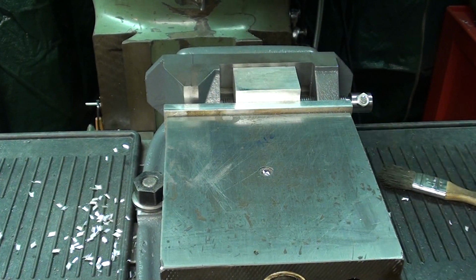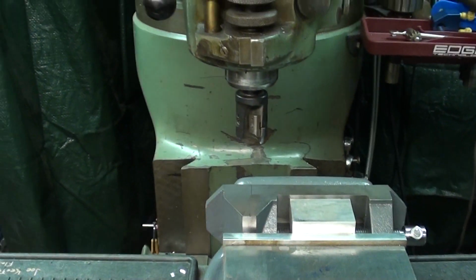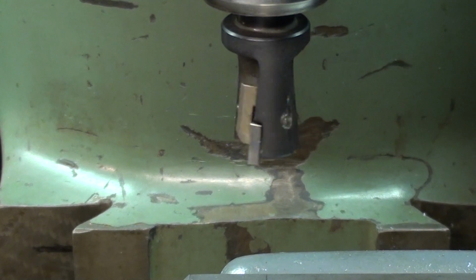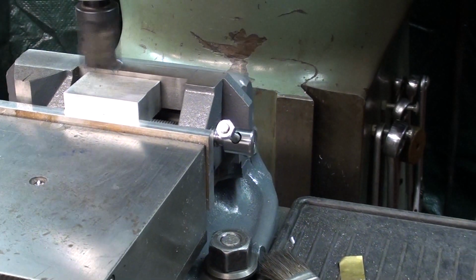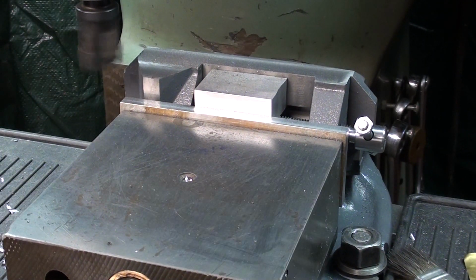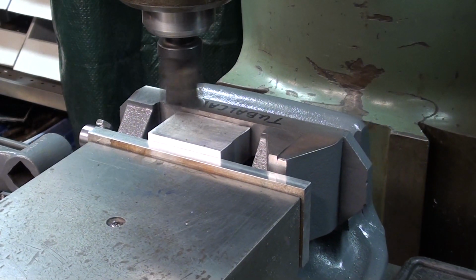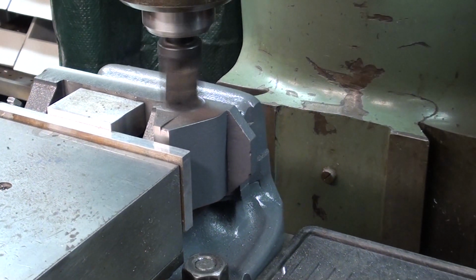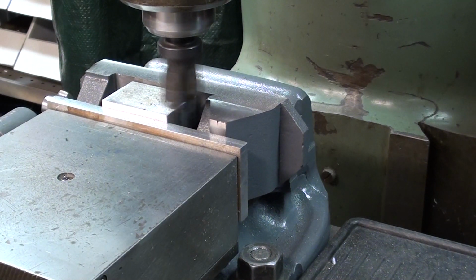And you can see that I'm not squeezing that or this. All of it is in the middle, and I'm using this 2-fluted carbide mill. 2 carbide inserts, I guess I should say. And I'll take one more light finishing pass off camera. And one more slow feed finishing pass, and then I'm done. I'll do that off camera.